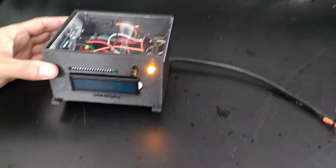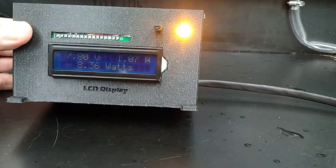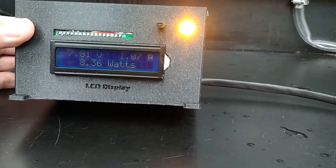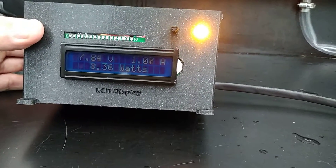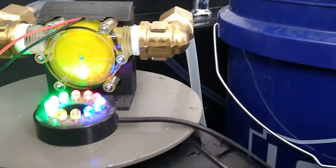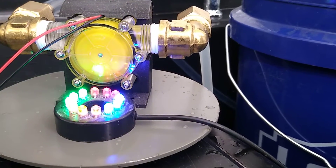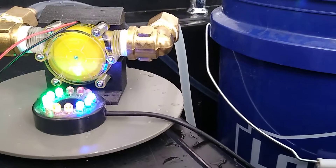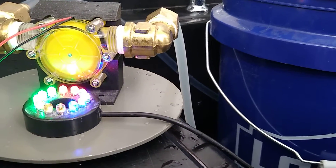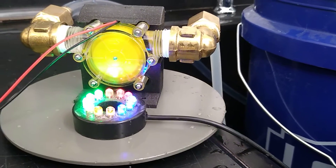You can see we have it set pretty dim because we want to conserve as much of the power being generated as possible. From this box, it would then go to an auxiliary device where it is then being charged. Right now our turbine over there is producing 7.8 volts and about 1.08 amps of current, which is around 8.36 watts. This module here — or 'measure meter' as we like to call it — is live monitoring the energy generation produced by the turbine.